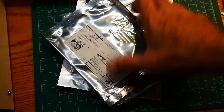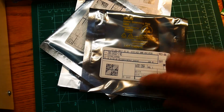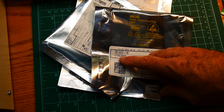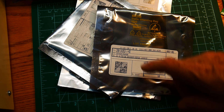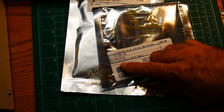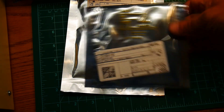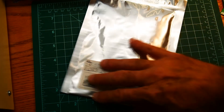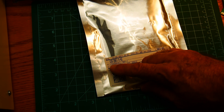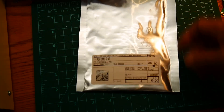HC 163 — those are my counters. HC 85 — those are my comparators. 154 — that's a 4-bit to 16-line decoder; I'll be using that on my state machine, we haven't gotten there yet but I ordered some parts for it. 573 — that's the 8-bit D latch. And last is the RAM chip, the CY 62256.